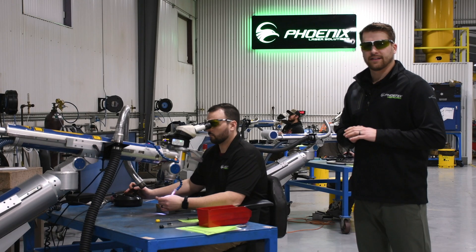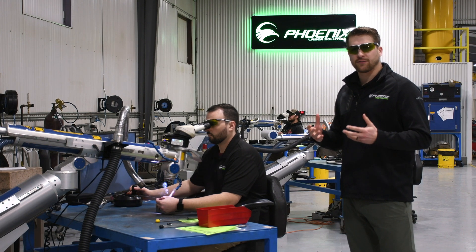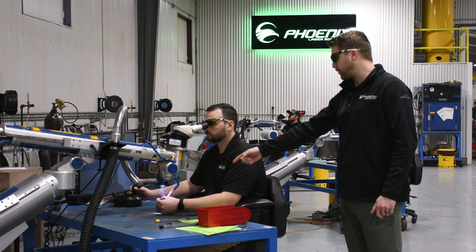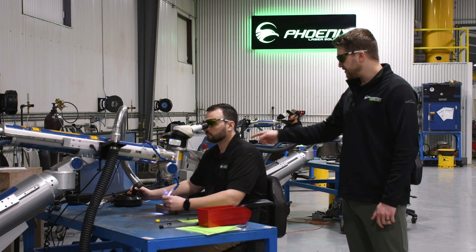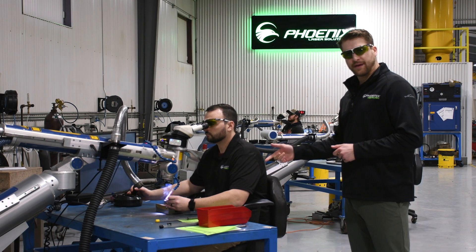For those of you who aren't familiar with laser welding: similar to TIG, however, instead of wearing the hood or shield you're used to with TIG welding, our operator is looking through a microscope that has crosshairs down at the workpiece. Instead of using a conventional torch, he's using a joystick with his right hand, filler wire with the other, and a foot pedal to power the laser.